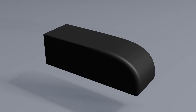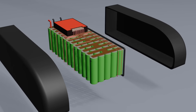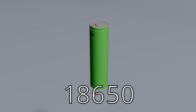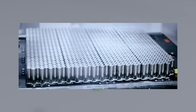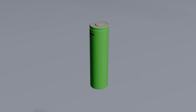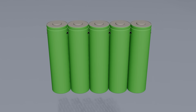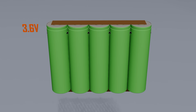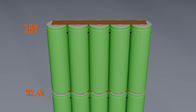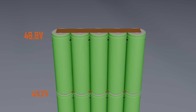If we're going to make an e-bike battery, first we need to understand how one's made. If we crack one open, we can see it's made of lots of small lithium cells called 18650s — used everywhere from electric vehicles to laptop batteries. The construction is really similar to the power bank we made last time: cells are grouped in parallel to add up their capacities, and an individual group is about 3.6 volts. To make a 36-volt battery we stack 10 groups in series, and to make a 48-volt battery we stack 13 in series.